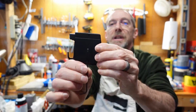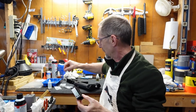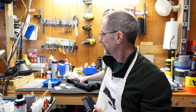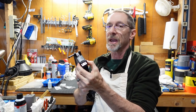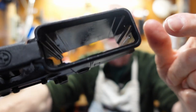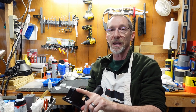R&D Precision includes these really tiny, really short screws with the kit. A little bit longer screw will grab more threads inside the adapter, holding it in place better, and depending on tolerances or clearances, when you put the adapter in, those screws may need to reach a little further than they're able to in order to bite into the inside of the magwell — especially if, like I did, there are a couple of little notches, screw hole notches, I drilled into the receiver using the adapter as a guide to help those screws bite into the aluminum and hold the adapter in place.